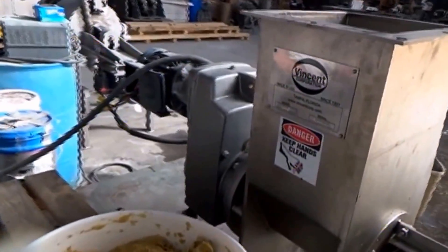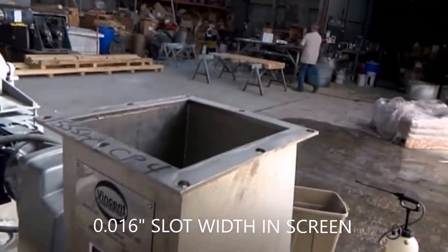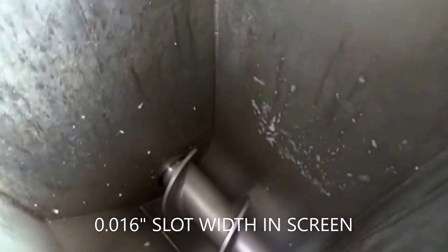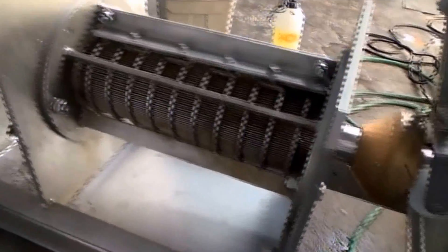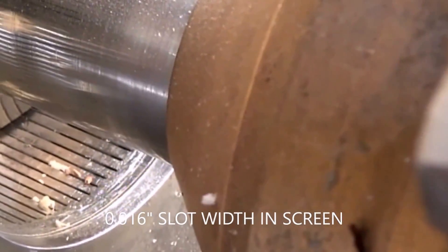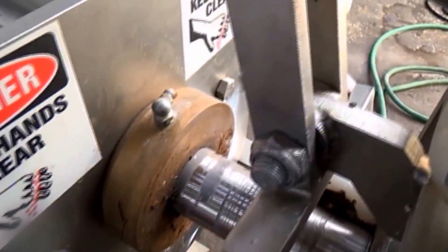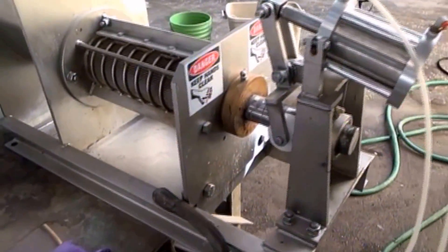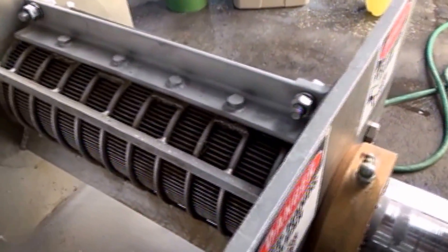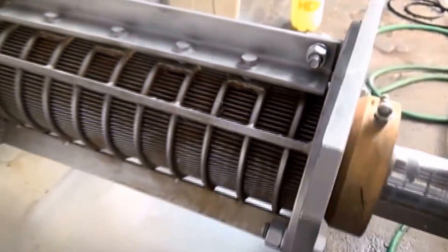We're going to give it a try on the screw press. We have a motor hooked up with a VFD, so when we vary the speed we're going to slow it way down. The components are: motor, gearbox, screw in the inlet hopper, a screen that lets water out, and a discharge cone. You can see the slots are pretty narrow on the inside — about 15 to 20 thousandths of an inch wide. We've got an air cylinder to apply back pressure. The air cylinder pushes in a bronze discharge door to create back pressure. What I anticipate will happen is we won't squeeze any water out — instead we will extrude it in ribbons through the slots of the screen. But that's a prediction.